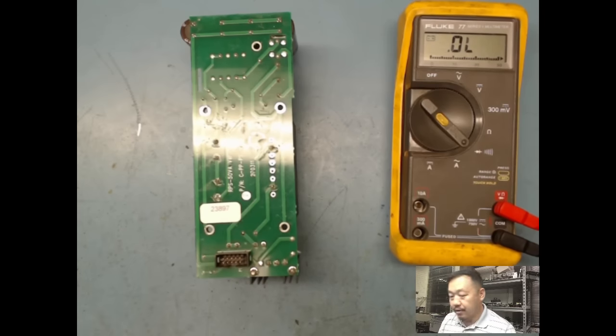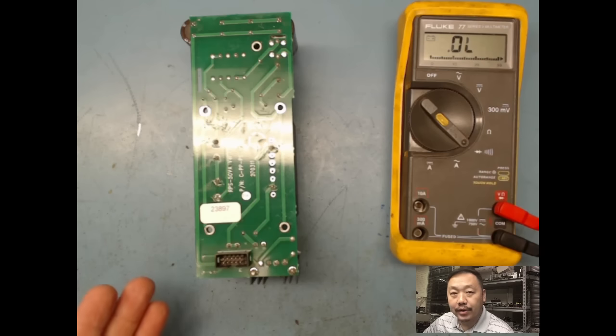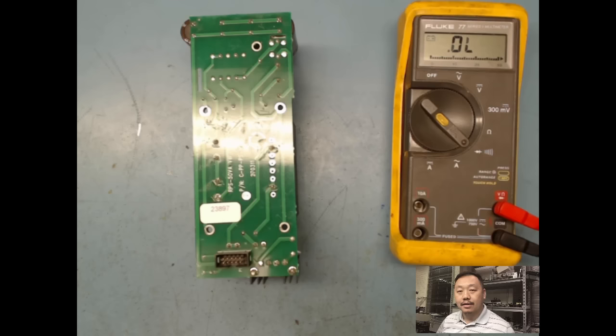Okay, so just by looking at it, I have no schematic, but I have a little bit of an idea of how a power supply works and know my components, and there you go. I went through and have an idea of what to expect, right? I did a visual, did a component check, identified how to power up. With the markings on the transformer, I at least have an idea of the voltage that I'm going to get out. And how much voltage am I going to get on my AC, on my DC side?